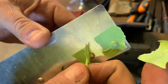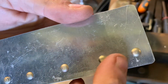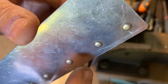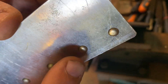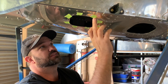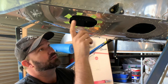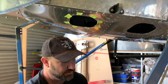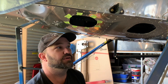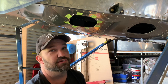Peel off the tape on this side - oh yuck, look at that. We call them smileys - the rivet snap has left a mark there and danced across the skin leaving a mark there too. There'd be much wailing and gnashing of teeth when that happens. The other ones - this is why I like tape on the rivet heads - they just turn out beautiful, nice and protected. Later when you polish or paint them that protective coating comes off, but right now that's beautiful. I've got my countersunk rivets loaded up and the tape's holding them in place. I don't need Clicos this time because the anchor nuts are holding the piece together. If you feel as though you need to wear safety glasses, hearing protection, gloves, or any other PPE, you should absolutely do that.